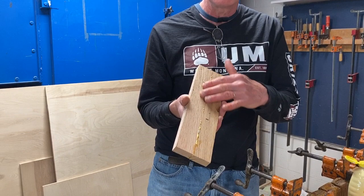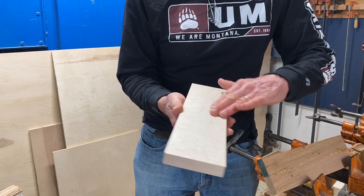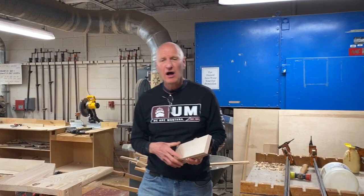I'll scrape it first. Then what we'll do is take a look at how we're actually going to bore the holes, cut it to width, and then go over to the chop saw and cut a 45-degree angle. Here's my glue joint — still kind of a little on the wetter side. The other thing I determined when I looked at this board of bird's eye maple is that this surface feels nice and smooth and even, but this surface doesn't — it feels rough. So I'm going to send both of these boards through the surfacer to get them to a nice smooth surface for my wine holders.